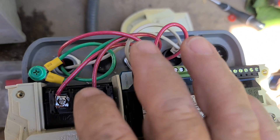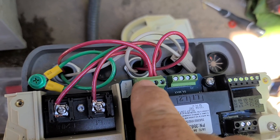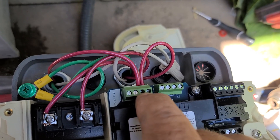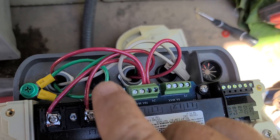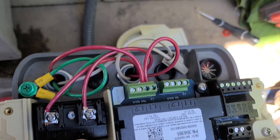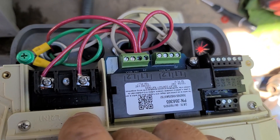This is the main power to the pump. You don't want to get that entangled with the other wiring — it's separate. You run from the breaker to the GFCI to this, and then from there over to the light directly. This is just a direct line from the 20 amp GFCI breaker that feeds the pump itself. Anyway, that's the video — you guys have a good one.